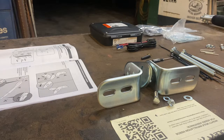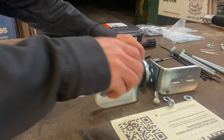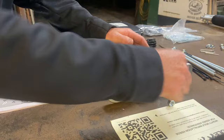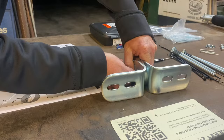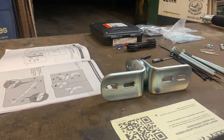We're going to be doing the pull-to-open operator mounting, which calls for these two brackets and this single bracket to be bolted together. We'll go ahead and line this up, throw our bolt through it — it requires a washer, a lock washer, and the 3/8 nut. We're going to just hand tighten that for now; the instructions say don't tighten anything all the way yet.